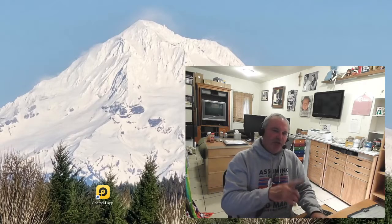Good morning, good afternoon, good evening — whenever you're watching, thank you for watching. I'm Gordon with the YouTube channel 'This Is How I Did It.' This video is about waterwheel gearing — the pulley setup for our waterwheel. We have a seven-and-a-half-foot tall waterwheel with a five-and-a-half-foot diameter pulley, and we're showing multiple configurations of different size pulleys to get the rotations needed for our generator to produce power.